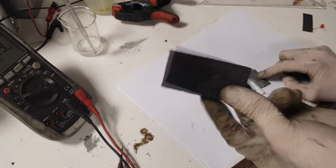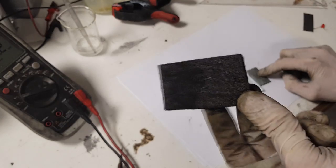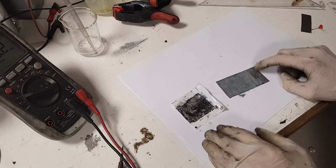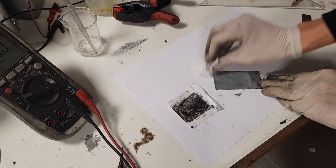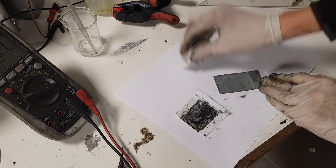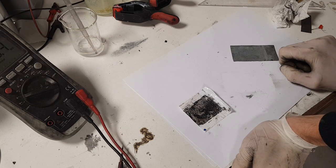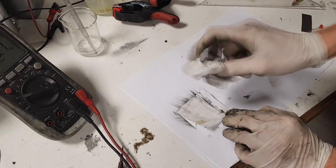This was the cathode — a mix of manganese dioxide and carbon black on carbon fiber — but we don't need this one. We do need this separator. And the zinc anode I will clean a little bit. The internet — I mean YouTube — is crazy about this zinc hexacyanoferrate battery, so today we will try to make a modified version of it.